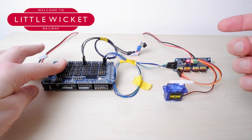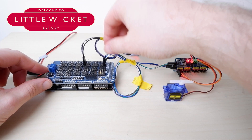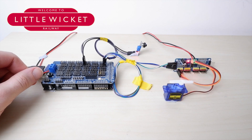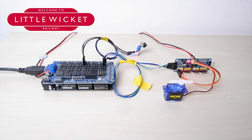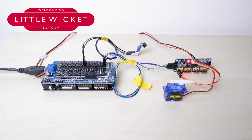So here's our hardware from the previous video. We've got the Arduino Mega with the sensor shield on top. The sensor shield is connected to an external 5 volt power supply. On sets of pins 20 and 21 we've got the PCA9685 servo driver board with our servo connected on the first set of pins — that's also connected to the external 5 volt power supply. To quickly recap part one, we configured set of pins number three to be a sensor input and plugged in this infrared sensor. Remember we had to start at set of pins labeled three because we can't use pins labeled zero, one, or two — they're already being used in other parts of the code. This input could be any compatible sensor, for example a block occupancy current sensor, a photo sensitive sensor, or even a simple switch. So for inputs this setup is really useful and flexible.